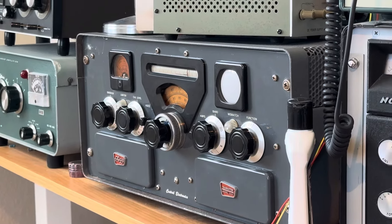And I just finished working on the 300 over here, which is probably as good as it's going to get. I just got done calibrating this thing and aligning the dial scales for linearity. I've put in the best tubes I can find and I've aligned it three times now to get it perfect. The case on that needs to be painted desperately, so I may take that piece into the store and try to get the paint matched.